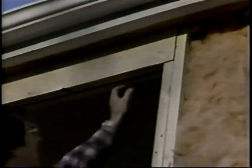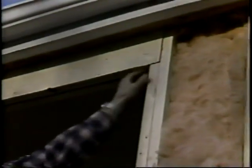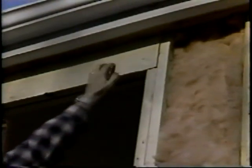Yeah, plaster work, which I don't really want to have to do myself because I tend to drop the stuff all over the place. The framing looks good. Let me take a look up here to see what you have. What size are these timbers in this header? Those are 2x8s. You can't see all of them because they go in above the overhang. Okay, and you got spacers to make it the same thickness of the wall, and you nailed it from both sides about every 8 inches like this?